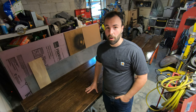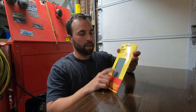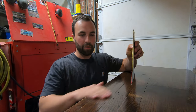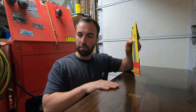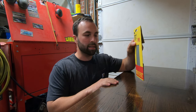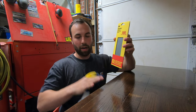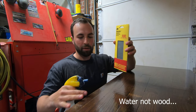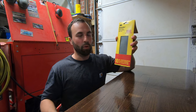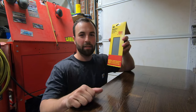I'm going to show you how to wet sand these and buff them out so you get a glass-like finish. To start, we're going to use some 1500 grit wet/dry sandpaper — this will smooth everything out. It looks pretty smooth and glass-like already, but it's actually rough to the touch; there are a couple little bubbles and some dust that settled in. I'm going to soak the sandpaper really well using a squirt bottle, trying not to get the wood too drenched — especially if there are any cracks. Keep adding water as needed so the sandpaper doesn't bind up.